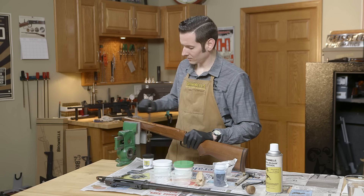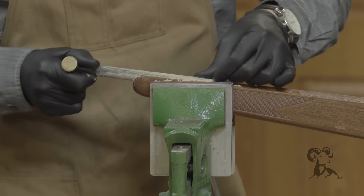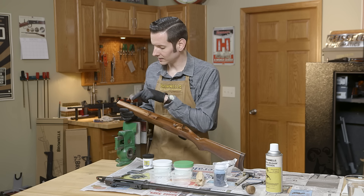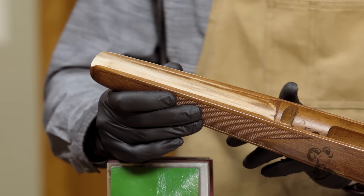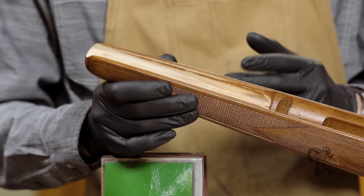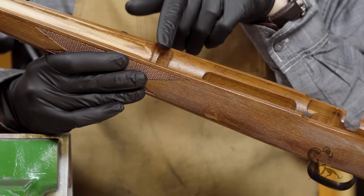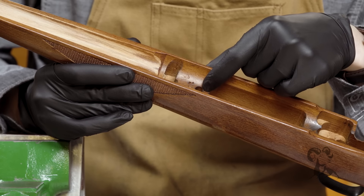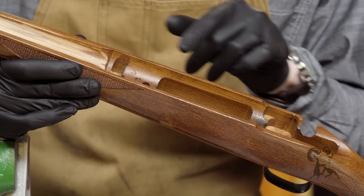Getting started, we're going to prepare the stock. As you can see, I've already cut away the barrel channel, got it nice and even on both sides of the barrel so it's not contacting. I have a bit of room to put the Acraglas in and get a nice solid fit that's going to float the barrel. Whenever I bed hunting rifles, I bed them the length of the chamber and float the rest in the forend — that gives excellent results for fitment and shot grouping. We're also going to bed around the recoil lug area and the front action screw, then move back to the front of the rear action screw.